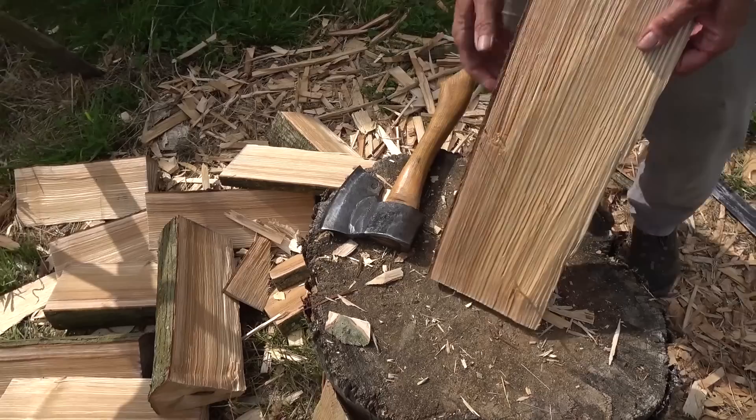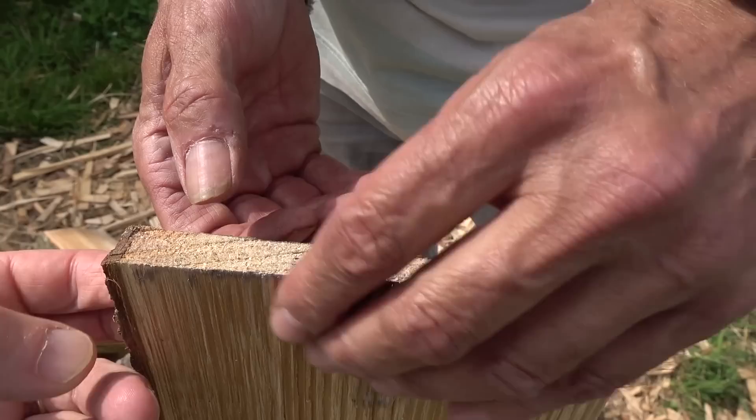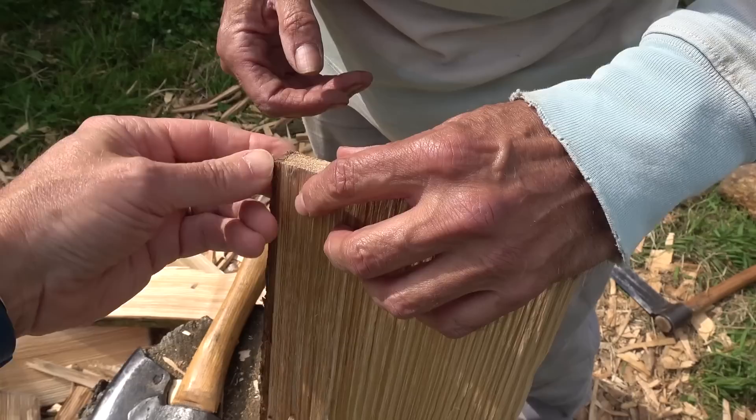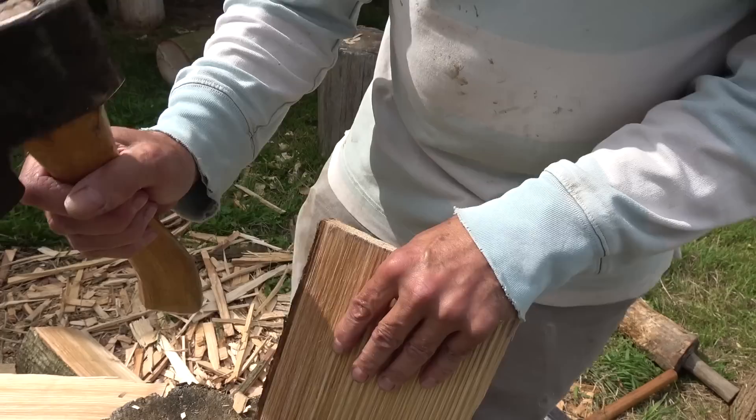The next thing we do is use the axe. With chestnut there's a very small amount of sapwood — that little white section there is the sapwood and that needs to come off. It's at the outer edge. Sometimes it's more pronounced, but on this particular slow-growing tree it's very small. If you didn't take it off it would just go piffy and rotten — it's basically carrying all the sugars of the tree up and down. The heartwood contains all the tannins, which are durable and acid-resistant.